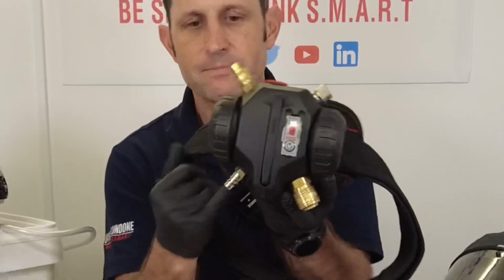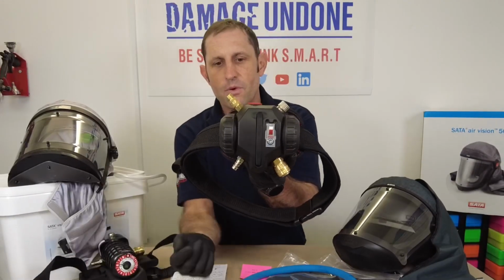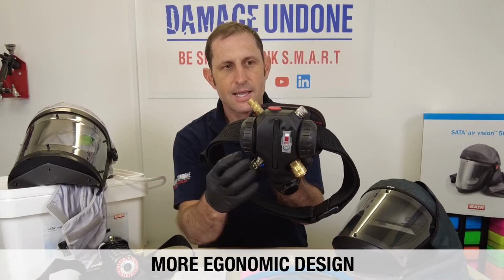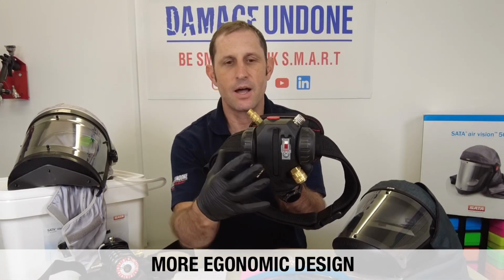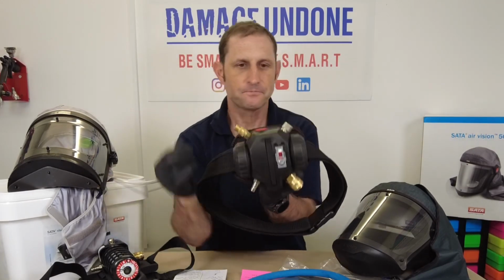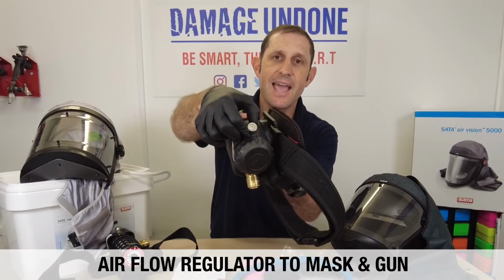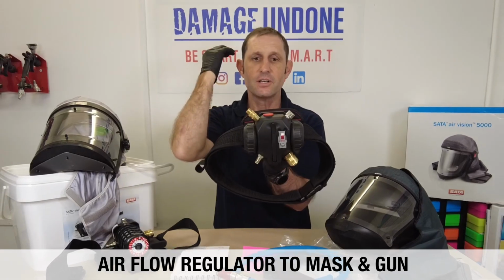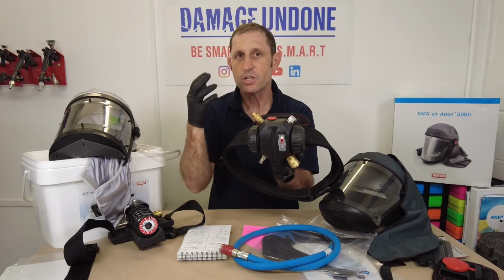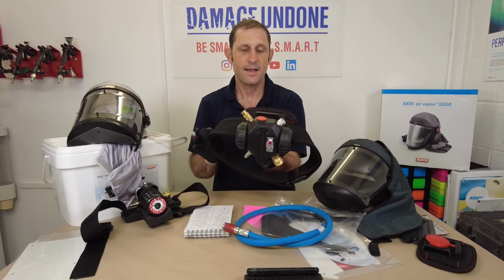You've got your air in, and again, see the difference here is your air in is coming from the bottom up. So you just don't have that pull on it. It's a much better design. You've got your air out to your helmet, and you've got your air out to your gun. Again, on here, you've got a regulator. So you can adjust the airflow to your hood and to your gun. So if you feel you need more air coming into your hood, you can just adjust that. If you feel you need more to your gun, again, adjust that there.